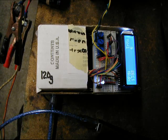Here is version 2 of the Coil Saturation Tester controller. This one is more compact than my first breadboard. It uses a direct wired LCD instead of an I2C LCD in an attempt to reduce the negative effects of RF noise. The 3 little pots control simulated RPM, coil charge time, and LCD brightness. The code is pretty simple. I can add a link to it in the description if anybody is interested.